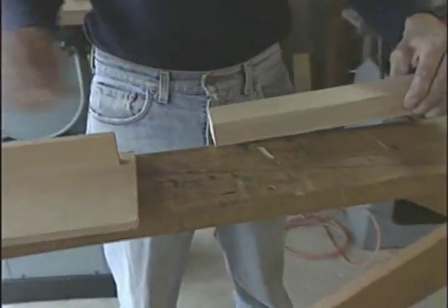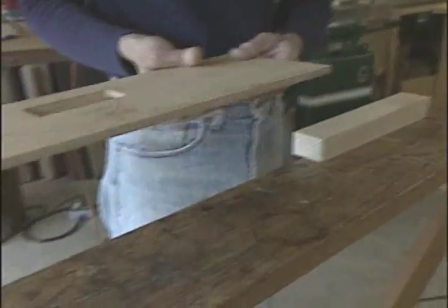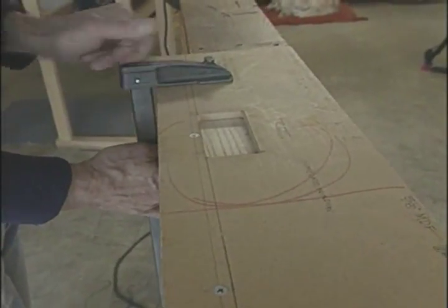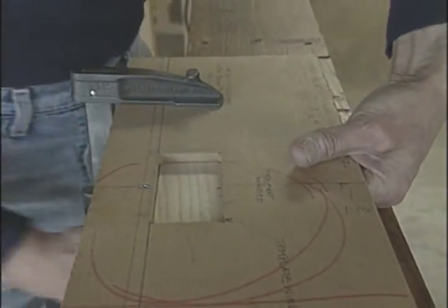This template, made earlier for another mortise, is proportioned to the collar guide for a 1x2 mortise. I made it with a fence to keep it parallel to the long edge of the mortise window. Make sure the template is securely clamped to the work.